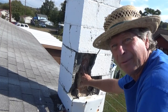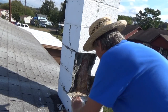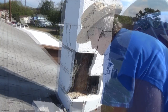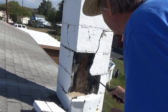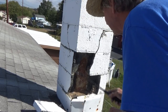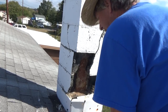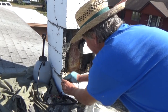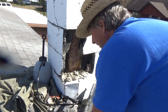That flue is wearing away too. Anything you do like this is only good for so long, and then you've got to do it over one way or the other. A sprayer's easier in all my jobs — I want to wet it so I want all that stuff to stick. I'm going to wet it first, then go mix my mortar and put it in. In the real world, I don't want to make a mess with a trowel, so I'm using my hand.